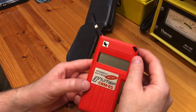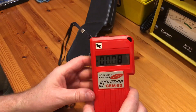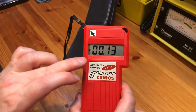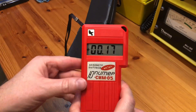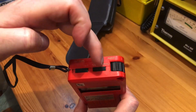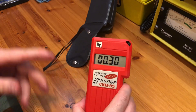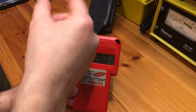You can have the alarm off or set it to three different thresholds. When you turn the unit on, it enters a 25-second search mode, giving you a base background radiation reading over 25 seconds, then updating every 25 seconds after that. If you want to search faster in an area you think is contaminated, you can turn on the quick mode which updates every two and a half seconds — ideal for taking a radiation reading off something very quickly.